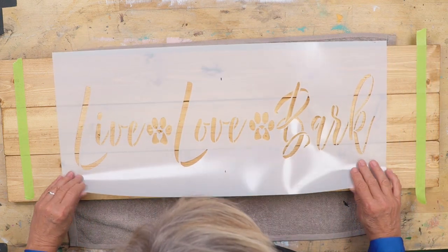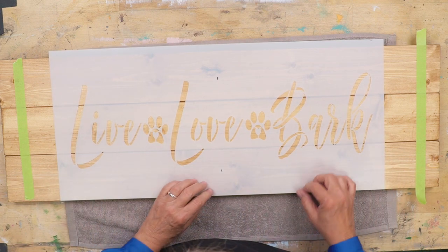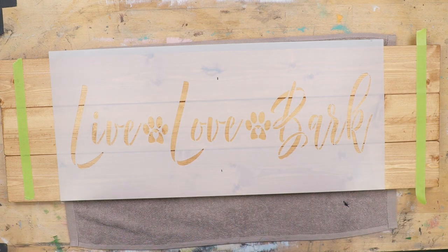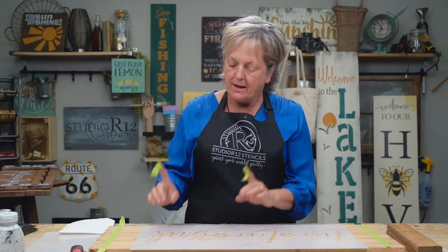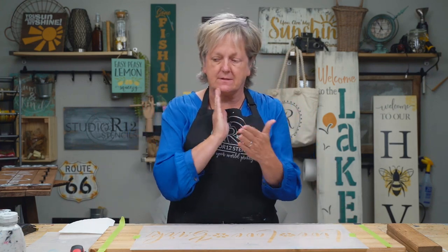I think resting on here is giving me a good balance of weight, so I think we're going to call that a good place to lay out. I'm going to use two pieces of tape and secure my stencil to the boards so that nothing shifts. If you only tape in one spot, your stencil will shift all over the place — you want your stencil stable. We're going to get our dome brush. The dome brush is the brush you're going to use so that you don't bleed under. If you want to see more videos about that, check in the description below or go see our playlist on how to stencil.